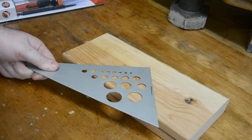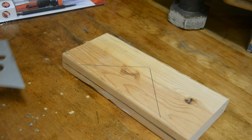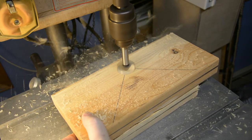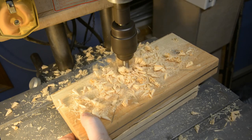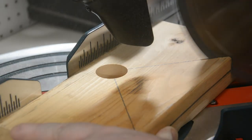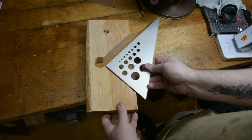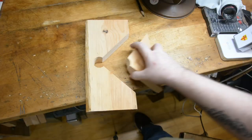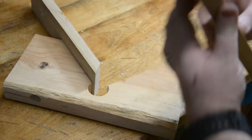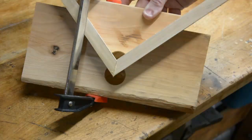Grab a leftover piece of wood you have around your shop, mark out a 90 degree corner using your square, and then go over to your drill. You're going to drill out where that 90 degree angle meets, so you have a little bit of wiggle room when you get your wood in it. Then take it over to your miter saw, cut out those lines that make the 90 degree angle, check to make sure they are perfectly square, and you're good to go. Next time you have a 90 degree corner to glue up, all you do is put your pieces back together, throw a clamp on it, and you're set for absolutely no money.